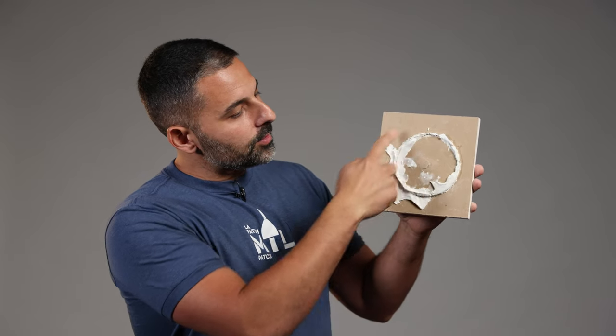Here's the beauty though: there is no wood, we didn't use any screws, there is no paper tape — that's the final result. It's impact resistant, and as you see here, there is no room for the sound to travel and no room for fire to travel either. The Montreal patch offers an innovative solution to repairing drywall. Unlike traditional patching or the California patch, it is way more efficient, less time consuming, and more profit in your pocket.